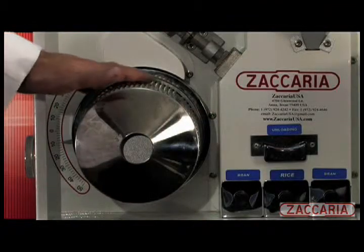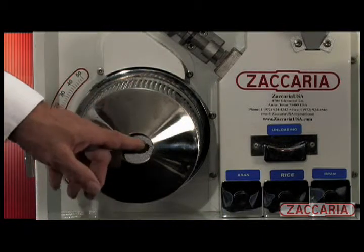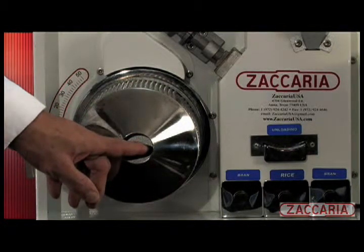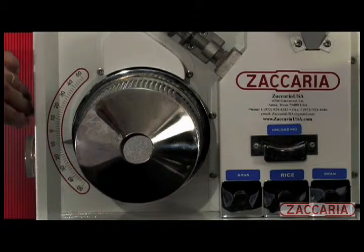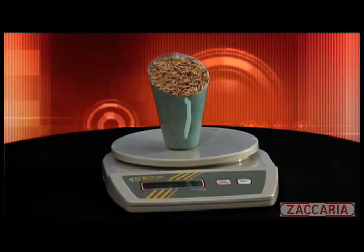Length separation is the final stage, where various pocket sizes are selected for different grade lengths, and the adjustable calibrated trough angle allows fine tuning for greater separation accuracy. The various fractions can then be weighed to evaluate the milling yield for each sample.